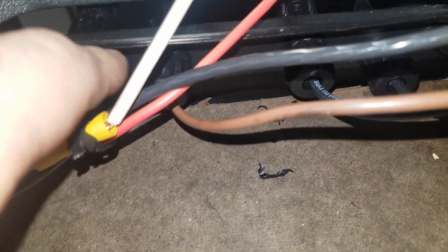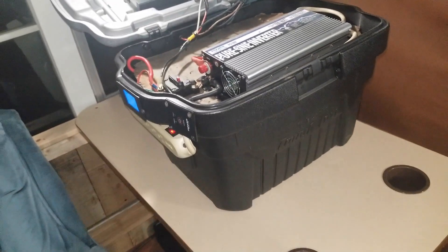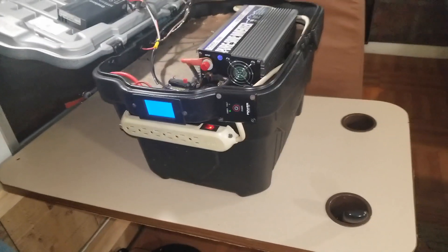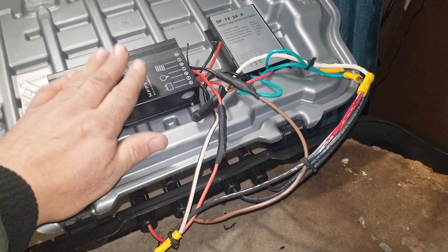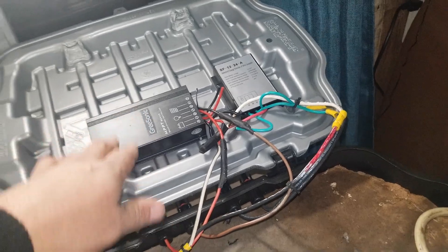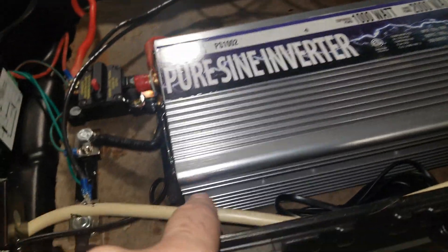That's a way that I can hook up or unhook without having to even open the lid. This is kind of a portable little power station — this could go in an RV, you could put it in your car, anything. This is a good way to have portable power. You don't have to have two charge controllers in it — this is just me because I've got several different sources of power for the cabin. I've got the solar panels and I've got the wind power, so I went ahead and added both. I'm going to have the water power one somewhere — I might do like I did here where I had to heat it up in order for the lid to close around the inverter.